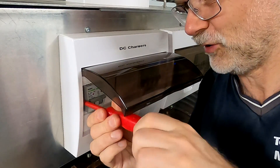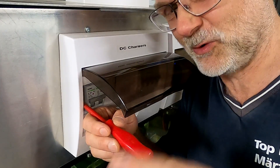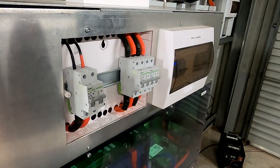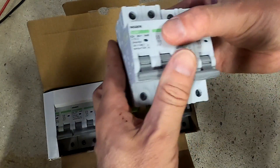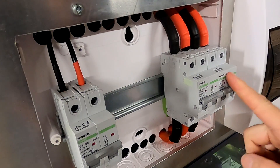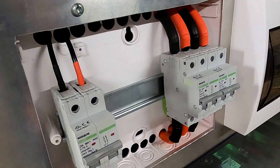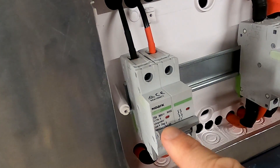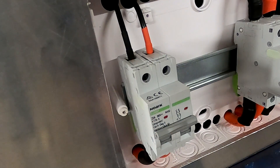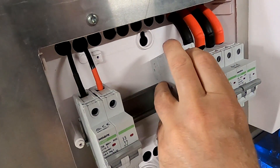We're coming now to the far more interesting part of the whole preparation video — far more interesting than mounting a switchboard in the carport. So we have here our east roof, our west roof, and this is the bus bar I have on my workbench for testing purposes. This is connected with a 4mm cable and to a 25A breaker, but now we are using the 63A breakers again for extending the solar charge controllers.